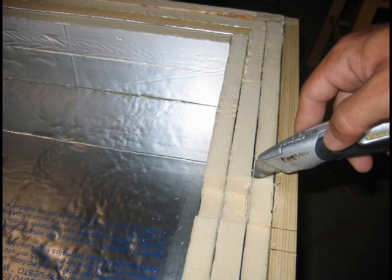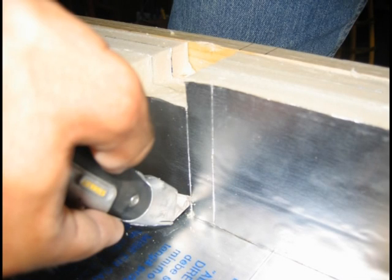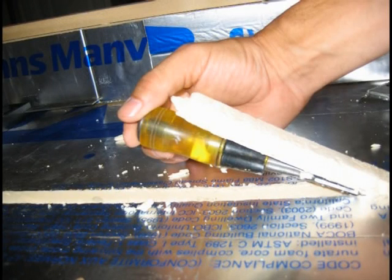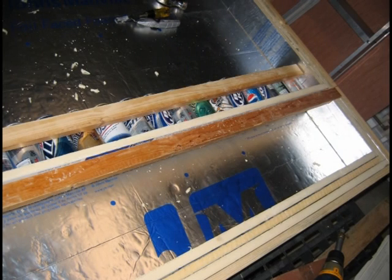Here's the picture of all the outer wall layers completed. This corner picture shows you how I've intertwined the insulation panels within each other to make a good airtight seal. In this next picture I am cutting and prepping the insulation for the installation of the top and bottom headers. I put the wood across there to be the main support for the header and secured it in. Next I'm cutting the insulation away that's going to hold the main support for the cans. It just kind of slid in like a shelf, and this gives you an idea of how the cans are going to sit in the empty airspace of the header.